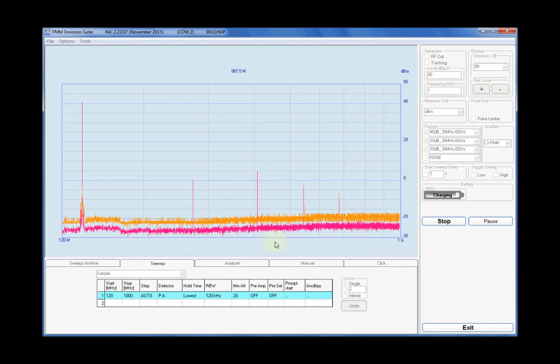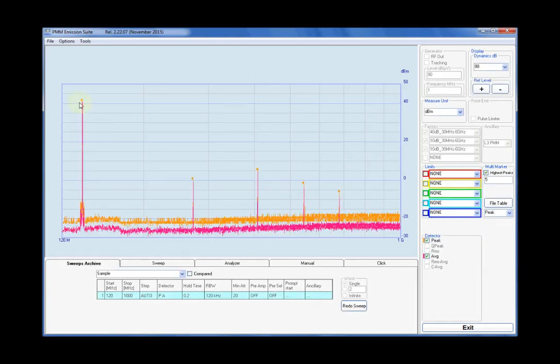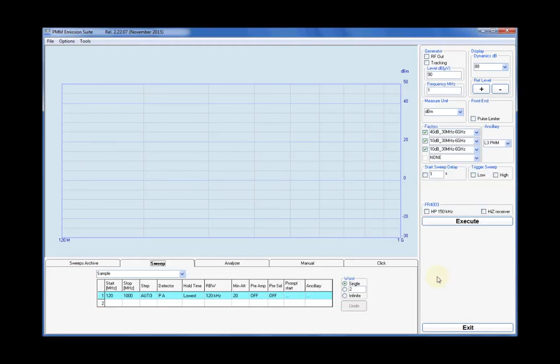The third step is a check of what happens when transmitting at the lowest frequency available, 136.0 MHz. The output level is a little bit lower, 40.9 dBm, about 12 W, and H2 minus 41 dB, H3 minus 36 dB, H4 minus 43 dB, H5 minus 47 dB.